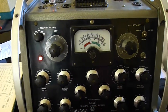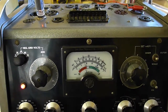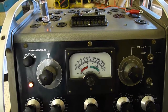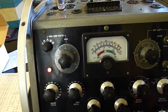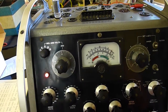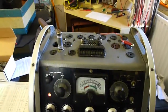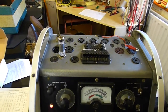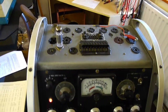So we turn the meter back and set these controls back to zero. Current's gone up a little bit, just over 32 milliamps now — it's way off the 48. So we turn the test off. There's no insulation breakdown inside. No short circuits at all. So we turn that off. Unfortunately, that old valve is going to have to be replaced — I'll have to put another good valve into the amp. I'll test the other valves: the rectifier valve and the little ECC83.